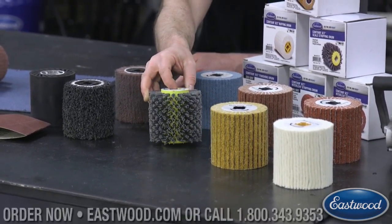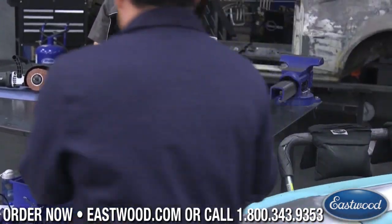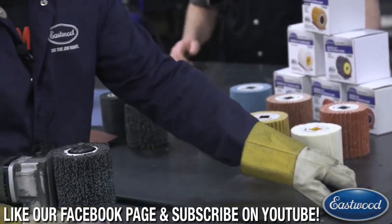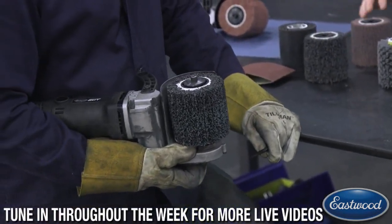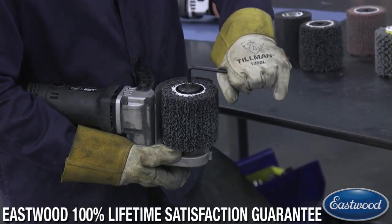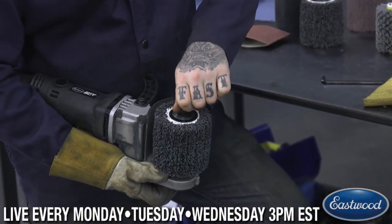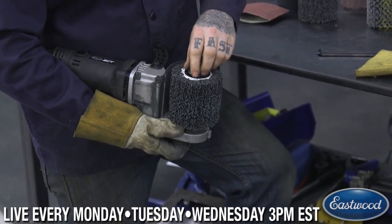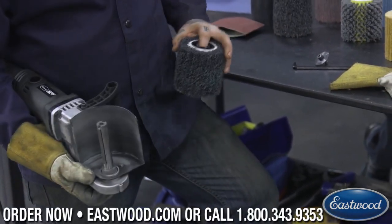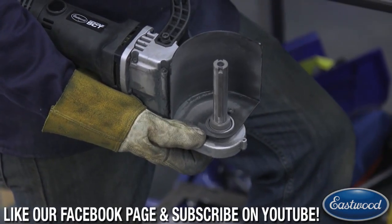It's good to add some of these drums to your arsenal, and it takes no time to swap them out. I'll start off and do the big area first, avoid all edges and bolts, and then at the end — or when they wear down — save them and use one of these around edges so you're not destroying a brand new drum. You just take the allen bolt off. It is opposite thread — we put a little note on the washer so you don't forget. It keeps it from loosening while you're running it. The cool thing is it has two keyways in it, so you don't have to worry about it stripping out or spinning the wheel when you're hammering down with pressure.